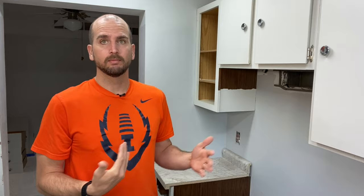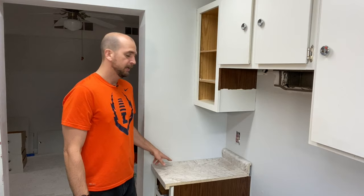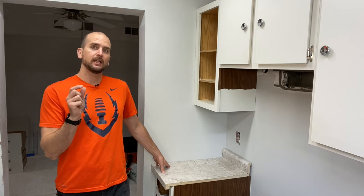So the question is: what can you do? If the gap is on the wall surface at the ends, they make what's called an end splash — instead of a backsplash, it's an end splash, and it gives you a very large gap coverage. Check if your countertop supplier has those available; in my case they're a two-week lead time. Additionally, you're going to put a silicone bead between the wall surface and the countertop, so if the gap is an eighth of an inch or less, you're probably fine. If your backsplash gap is three-sixteenths on one side and nothing on the other, you can do what's called scribing.